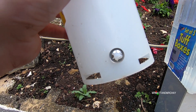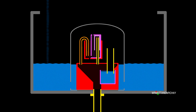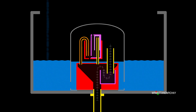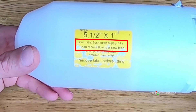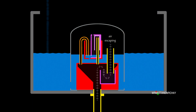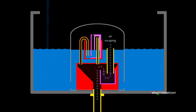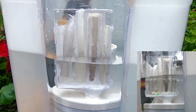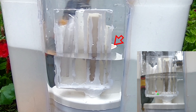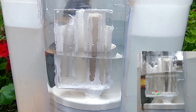This pipe, mounted slightly higher than the inlets, allows air in to clear down any remaining water. You'll notice that the water in the water trap is retained. Here is what would happen if this water is absent — this situation is also mentioned on the side of the capsule for the installer. No water in the water trap means that air can escape the capsule and the first phase siphon and the second stage air valve cannot control it. This means the water level does not stop short, and water overflows into the main flow pipe, filling up the water trap, which eventually seals the air from escaping and normal functionality is resumed.